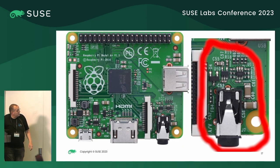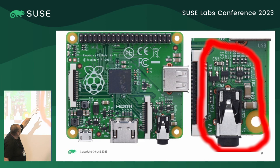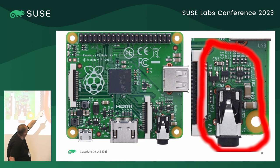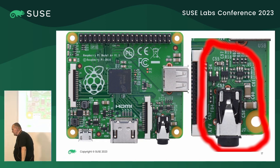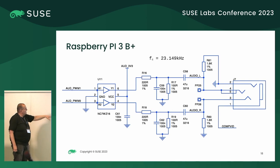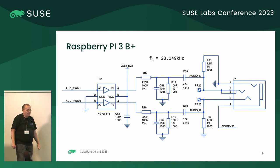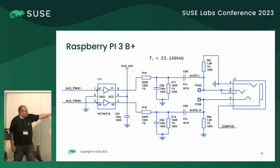I'll show you how it looks on the Raspberry Pi. On the Raspberry Pi, it's basically this part — there are two resistors for each channel, the filter is here near to the buffer gate. This is how it looks on the Raspberry Pi A+. On the Raspberry Pi 3A, it's much cleaner because they take 3.3 volts, a gate, a buffer, and then the filter — those capacitors so that it goes only alternating current — and a resistor so that it's biased to zero, so that you don't make a boom when you put the jack in. So I decided to go with this solution.